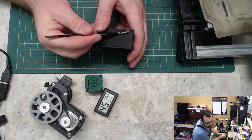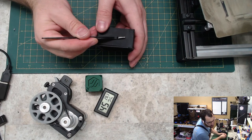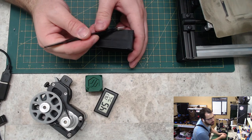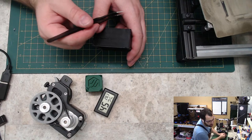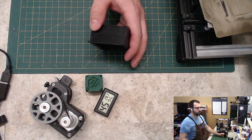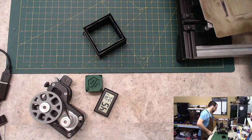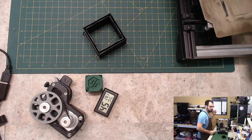Okay. So we have bulge, bulge, bulge, bulge. Okay, pretty good, pretty good. And it goes crap again. Now, if you were to continue printing it, it would just keep getting worse and worse. It's already bad. We know it's bad. We don't need to go any more. Okay? Oh, yeah. I'm plugging the fan. Let me see here. Let me just make sure it's cooled down enough. Oh, yeah. It's already down to, like, 50.